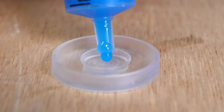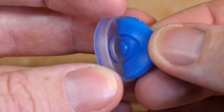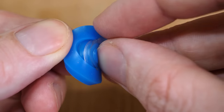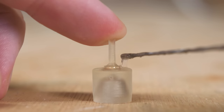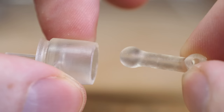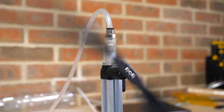To create such a thin wall piston seal, I printed a positive mould of the seal and used silicone to create a negative mould. This means the final mould will be flexible, which not only helps with filling all the gaps without air getting trapped, but once the rubber has dried, I can easily peel the piston seal away from the mould. Then the seal can be glued to the piston to make sure only the flange will move. And this new piston also has the internal socket dome for the connecting, or not so connecting rod, to seat within. Only issue is, it doesn't run.